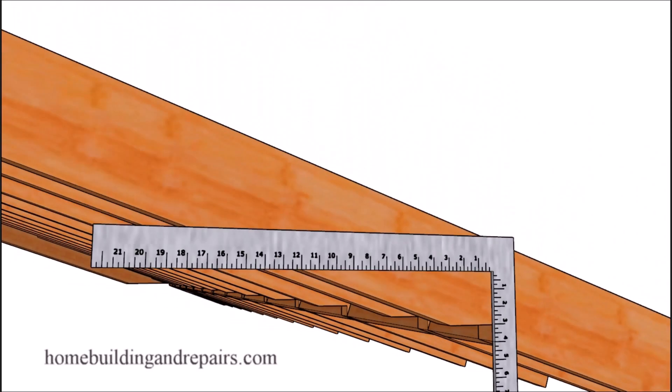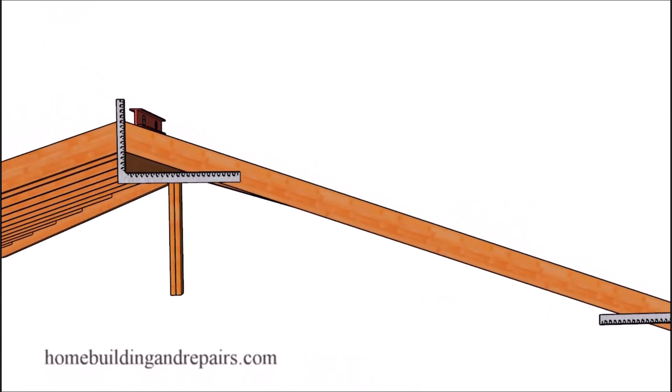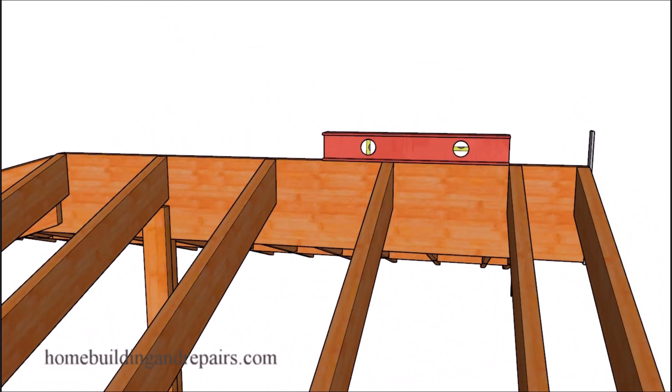Let's go ahead and head to the top of the roof rafter, where we are going to flip the framing square over — just simply rotate it 180 degrees — so that we can lay out and mark the top of the common roof rafter. You can see where the ratio is 4 and 12 here. This is not going to be the same for the hip. The ridge will need to be level, and in our example we will have square cuts on each end of the ridge.